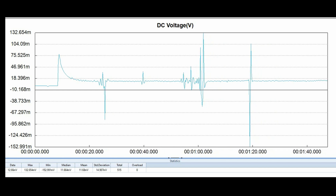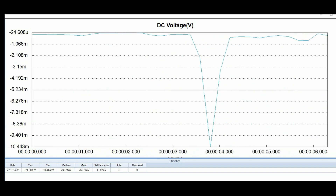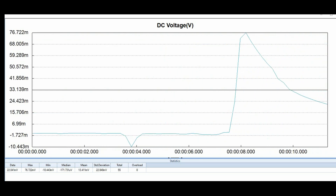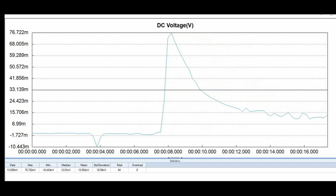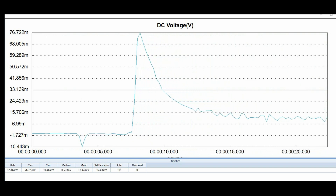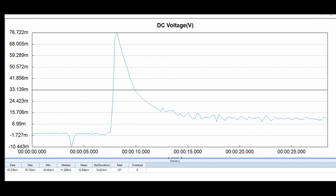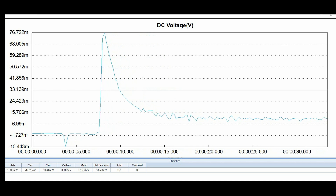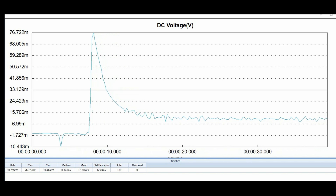When you've got DC voltage riding on your speaker outputs like this, it's not a good thing. Even though possibly this amplifier will continue doing this for the next 50 years and you'll never have any issues other than poor sound quality, there's a good chance at some point the amp is going to go into protection mode because the failure will be bad enough. You just have to hope that when that happens, it doesn't take out your vintage speakers along with it.